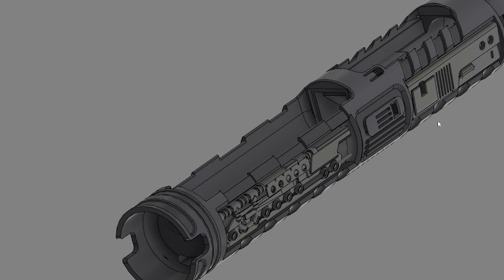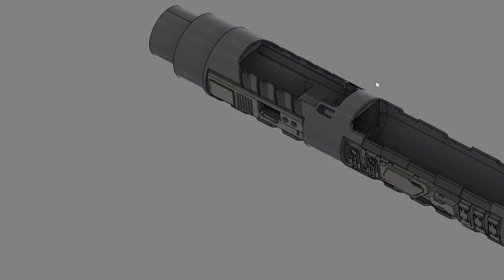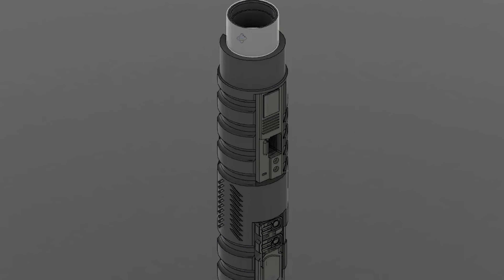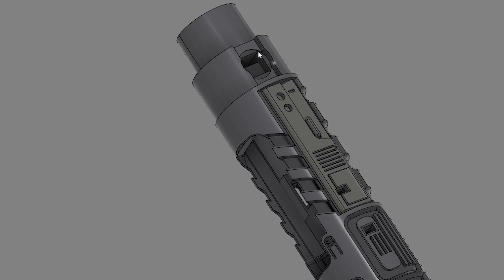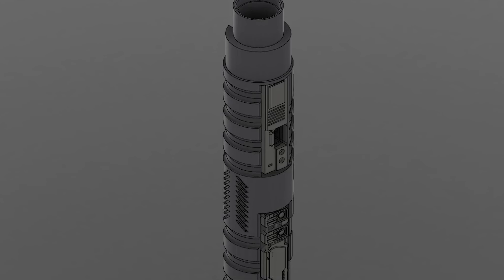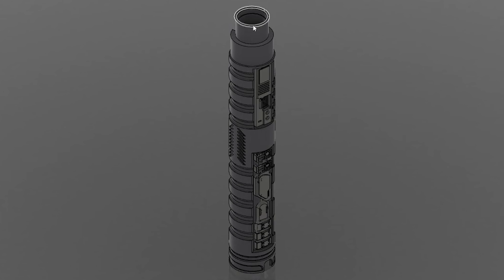This is how we light the red and green arrows in the control box of this hilt — one of the characteristics of Kanan's hilt, one of the things I love about it, along with the removable emitter. Above the battery tray is our Proffieboard tray, and there is a kill switch underneath that tray as well. This is a single button setup — there is a red tactile button up here, and this is what the switch at the top of the hilt makes a connection to. Making our way up top, we have our lit PCB emitter. I designed the chassis such that the emitter section, or the SUBA section, is removable.